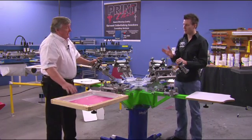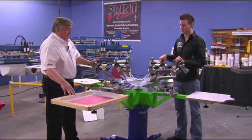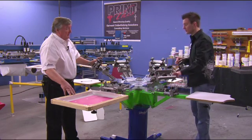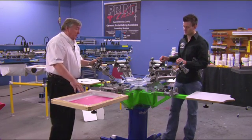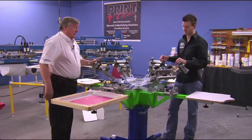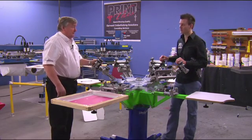So if you basically keep your press clean and make sure — it's very important that everyone in your shop knows how to use the press and knows what adjustments are needed. Basically the only three adjustments are the two off-contact bolts and the tilt bolts. You're pretty much good to go for quite a long time. But you need to make sure that whoever's going to touch this press knows what they're doing. And shoot the person that touches the stop bolts — I'm serious. Because you're screwing up the press. That simple.